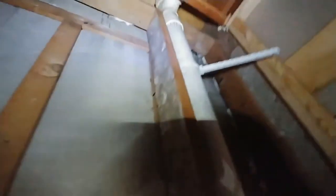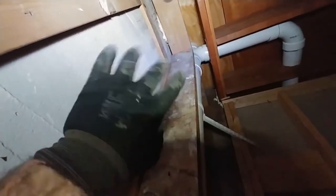you want to stay away from the face of it with water so that it doesn't get punctured. You know, our upstairs wall is basically on the gap, because the stack comes up behind it. So yeah, it's basically in that gap. Now we're back here closer to the outside wall. So I'm saying, rather than being in the middle of this here, we may scoot it up a little bit, just anything to get more R value behind it. And that'll be our water supply.